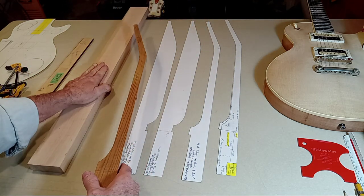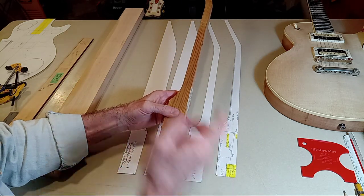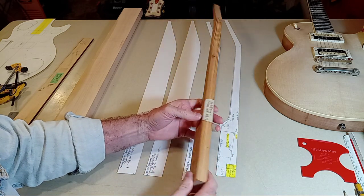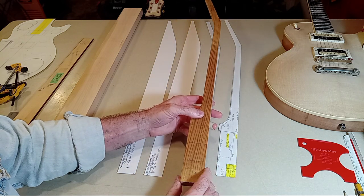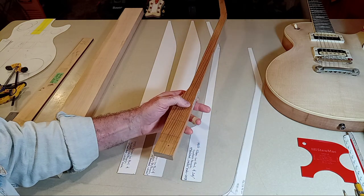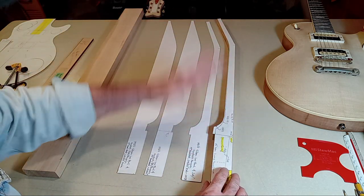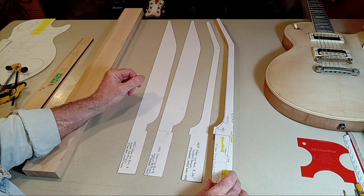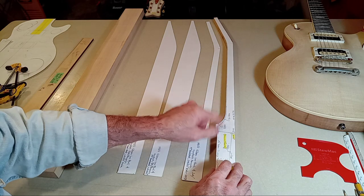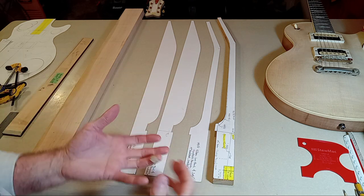According to the material that you're working with, you make that call. But if you've never done this before, don't go straight to your wood. Let's go to a piece of poplar — three-quarter inch thick, one-by-four, one-by-six, or just whatever. Go to your poplar, lay this template on the board and draw around it, and start experimenting on different ways to cut it out. There's literally three or four different ways — you make that judgment call based on your comfort level and the tools that you own.